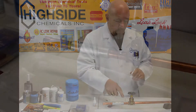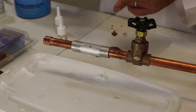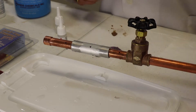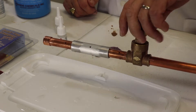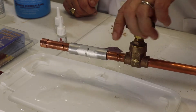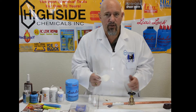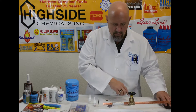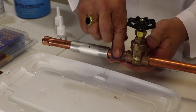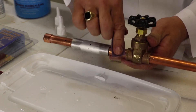So we have a hole in a copper line. By the way, we put all these products together just for copper. Right now I'm going to demonstrate — we have water in the lines and we're going to open that up. In preparation for your instant patch, the only thing you're going to do is make sure that you have a dry surface. Take some 60-grit sandpaper and go over the hole, roughing it up to ensure a clean surface to apply the instant patch.